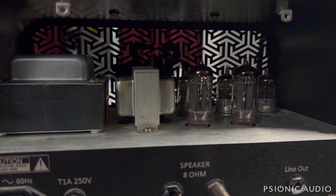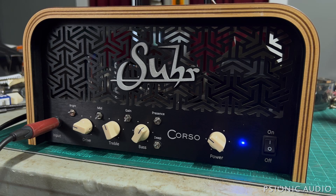It's a really good-sounding amp. We've got a new Mullard Reissue 12AU7 for V1 — non-microphonic — and two new Tube Amp Doctor 12BH7A output tubes, and everything seems to be just great. I'm going to let it run for about another hour just to make sure, but I don't expect to find any problems with it. It's a really nice-sounding, versatile amp.